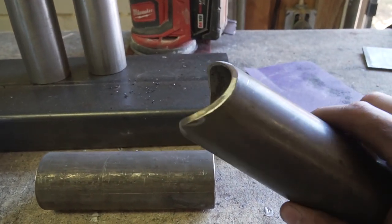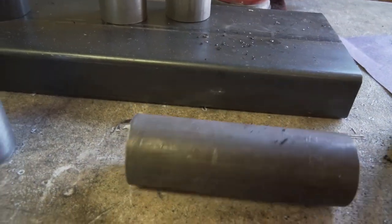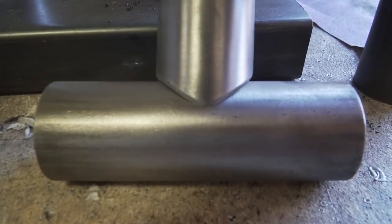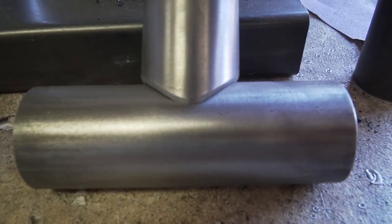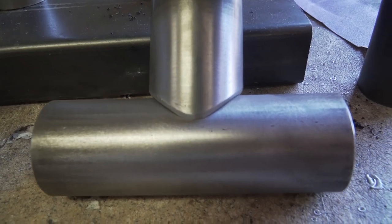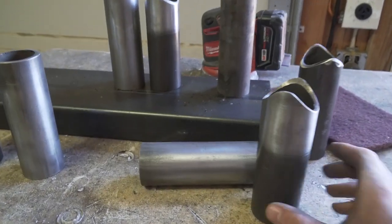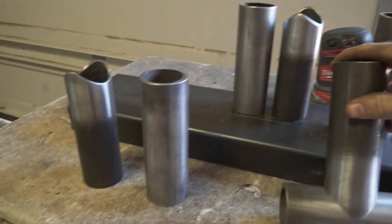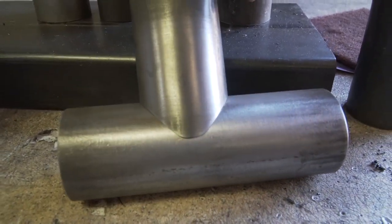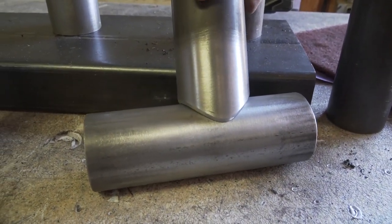As far as joint prep, putting a bevel in your tube is definitely necessary in my opinion for MIG welding. You can see the bevel in the tubing is going to give your MIG weld a nice little area to sit into and penetrate completely - which is also something you need to keep in mind when you're welding. It'll make the weld lay down a lot nicer and gives the weld somewhere to go. We have four joints total - I'm going to be doing two with the auto set feature and then two with my personal settings, so we'll have one joint standard and one with a chamfer for each process to show the differences.